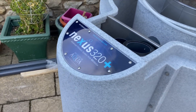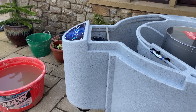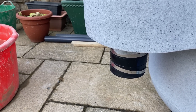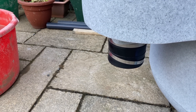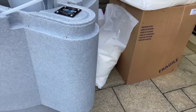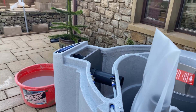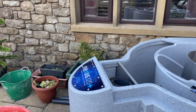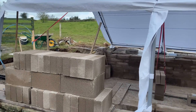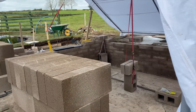The Nexus 320 Plus with the new media — another thing worth knowing: when a Nexus arrives it always comes set up as a pump-fed system. So that four-inch outlet pipe that's currently set up needs to be swapped — the four-inch flanged inlet needs changing over, because that's going to be the four-inch inlet for the drain on a gravity-fed setup. Then we've got the K1 micro bead with all the media, blower, etc. That's the equipment, and we're hoping to get it all installed in the next two or three weeks. The pond will obviously be fiberglassed, weather depending.